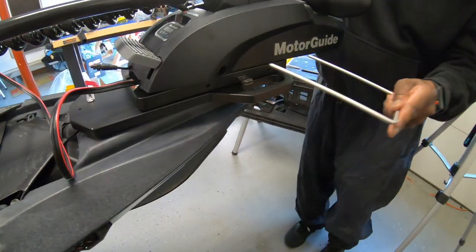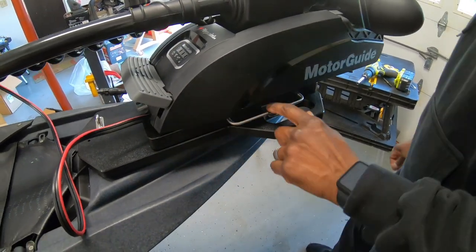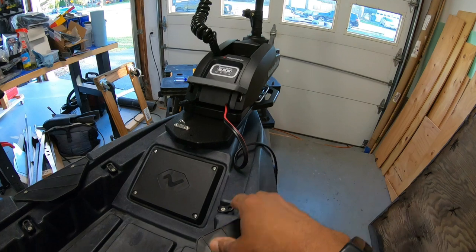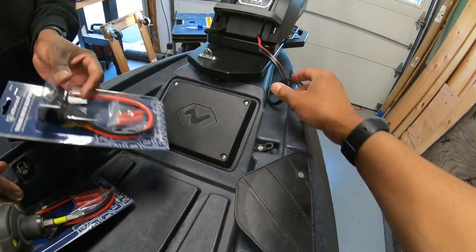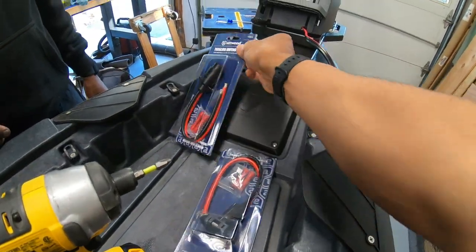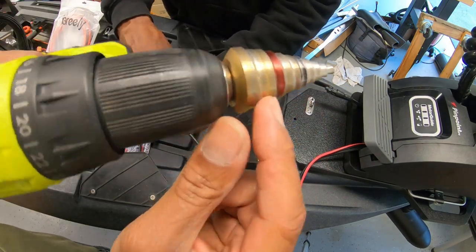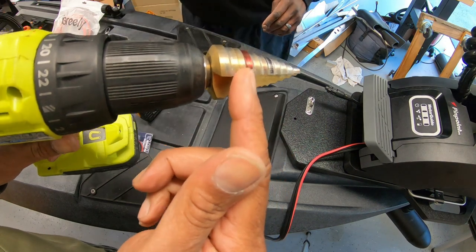The motor drops right onto the mounting plate. The quick release clip lets you pull out, lift up, and remove the motor easily for transport. Now we need to run power to it. We're installing a trolling motor port — an Atwood connector — for quick plug-in and plug-out. The female connector goes on the kayak and the male goes on the motor end. We're drilling the hole for the trolling motor port using a step drill, marking the stop point with a Sharpie at one and one-eighth inches.